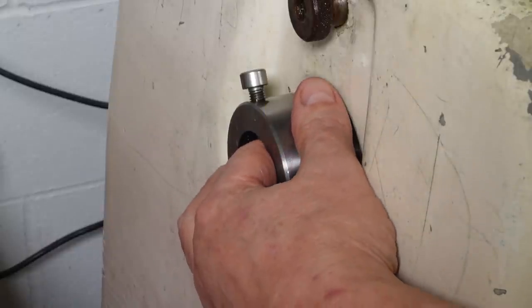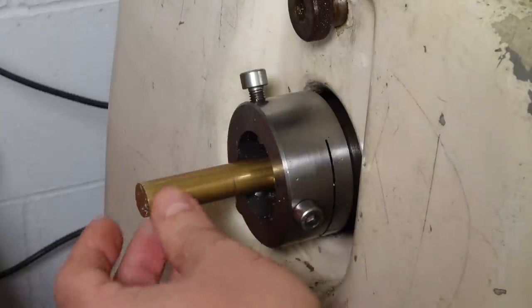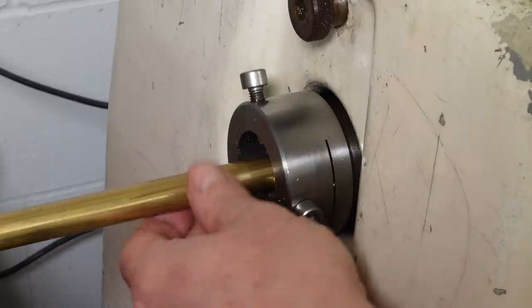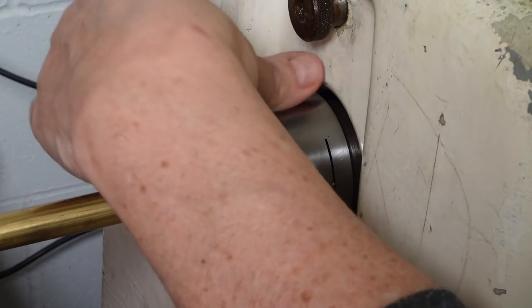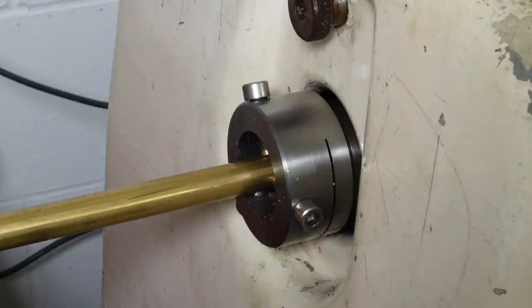So I used a headstock spider I made a while ago to support the bar through the lathe headstock, to help reduce any risk of the free 80 cms or so of the bar bending and whipping round at 1000 RPM, which is roughly Mach 0.25, 187 miles an hour or 300 kilometers per hour, enough to cause major inconvenience to the ambulance service and the accident emergency department of the local hospital.